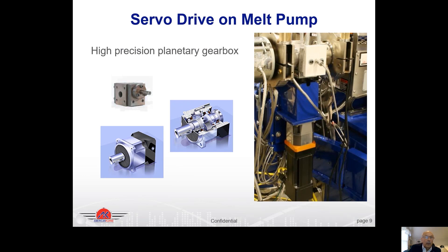You can also add a melt pump while keeping the footprint quite small with a modular extruder. Here you see a melt pump and drive system mounted vertically with the servo motor on the bottom, servo gearbox coupling, and then the melt pump in line. It's all mounted on a rugged swing arm so you can swing it into place when using it and swing it out of the way when you're not. Since you can change the module size, you may also want to change the pump size, so we provide a variety of mounting positions to accommodate different size pumps matched to the barrel modules being used.